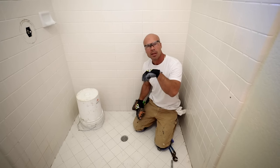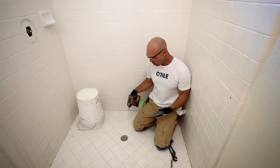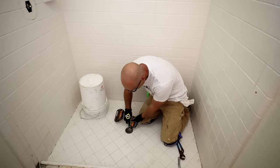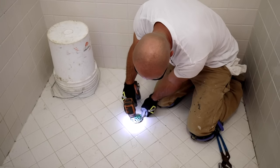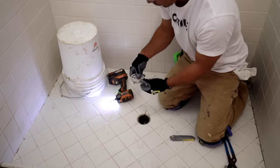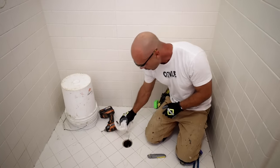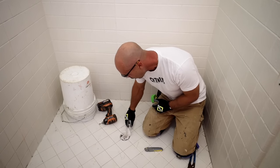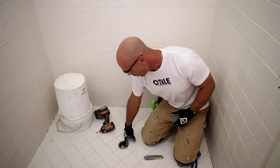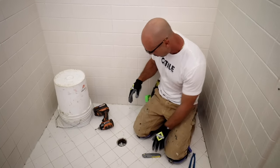If we're not replacing the trap, we want to protect against any debris. We're going to have a lot of dust and tile chips and cement - we don't want that going down the drain and clogging up the sewer. So I'm going to take these two screws out. There's the drain cover - just two screws. I like to take a rag and just put it down in there, so even after we take off the whole drain body, we're protecting the sewer pipe from getting any debris down into it.